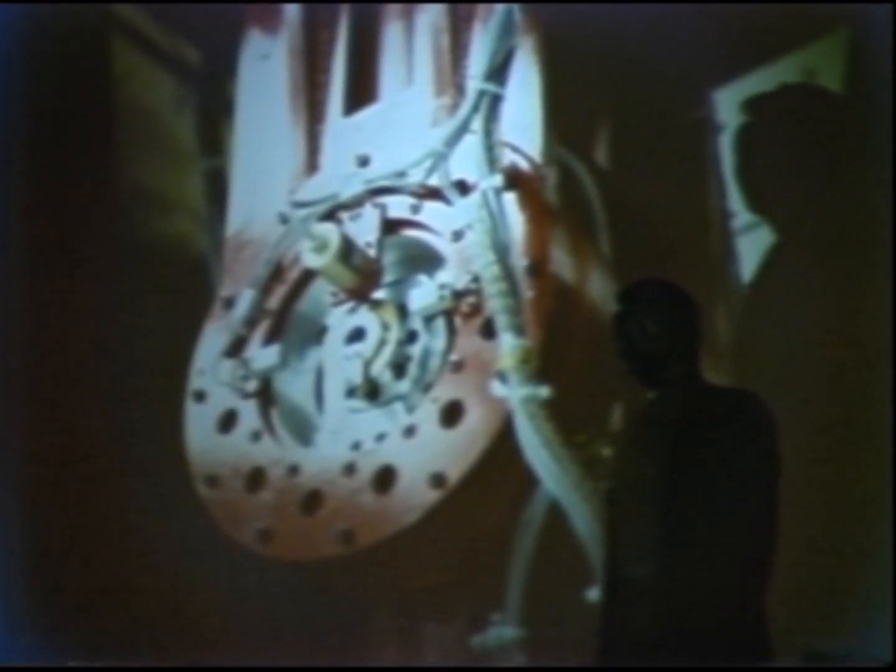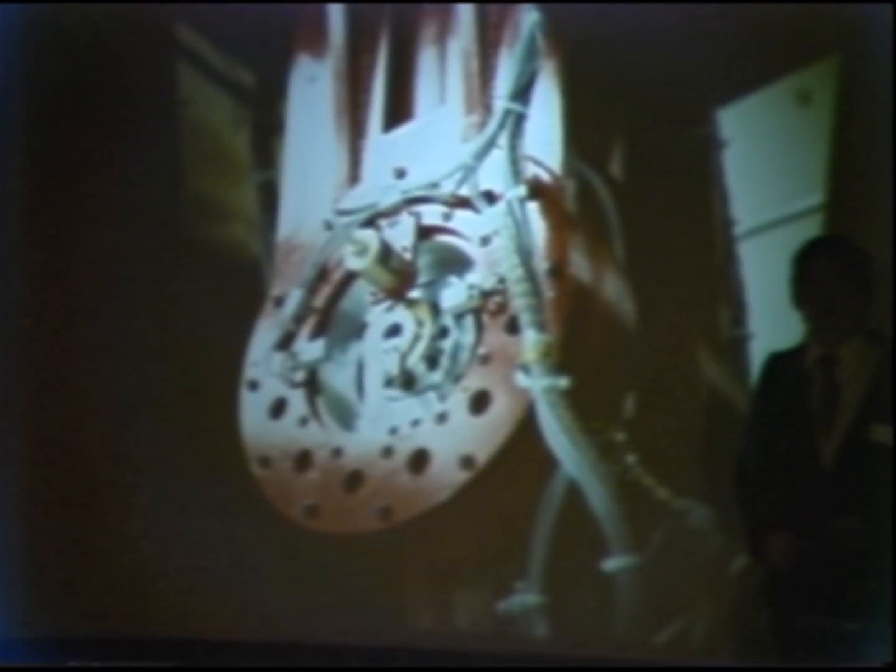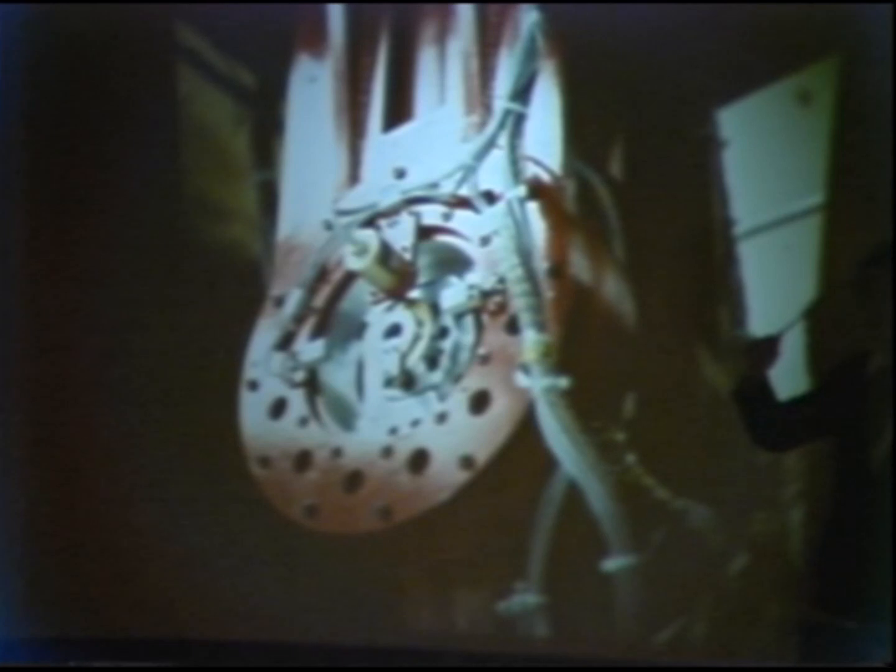This is the shoulder part. Here you can see the bare motor, which consists of a stator and rotor, working here. To get the huge torque to rotate this whole arm directly, we use a large diameter motor. It's about 60 centimeters, and the peak torque, the maximum torque of this motor, is about 200 newton meters. It's 150 foot pounds, I think.